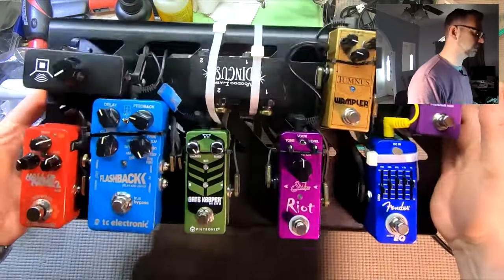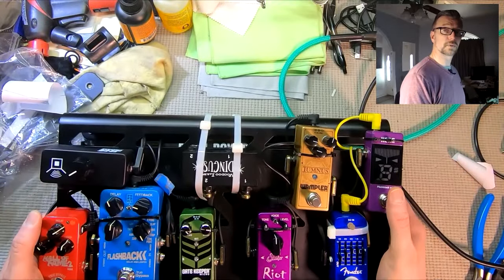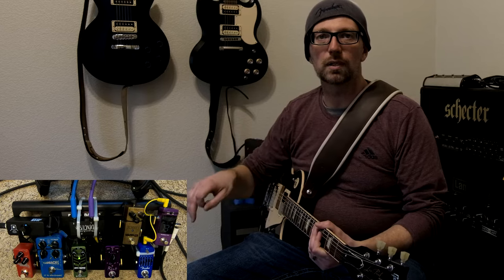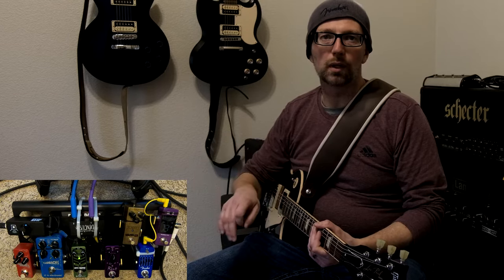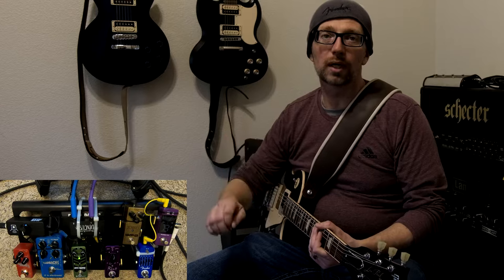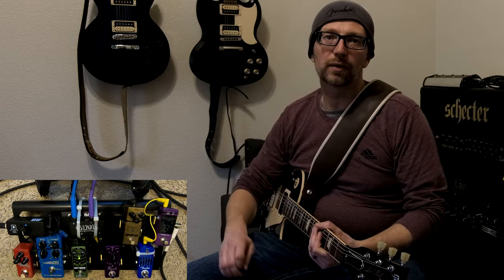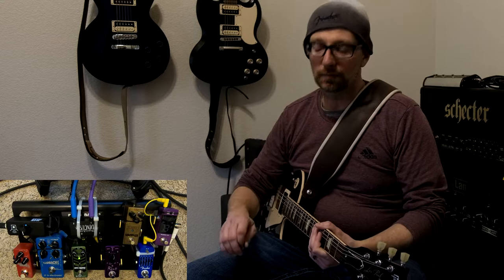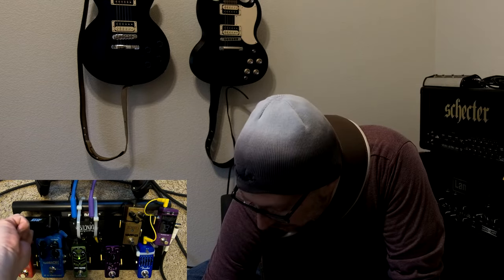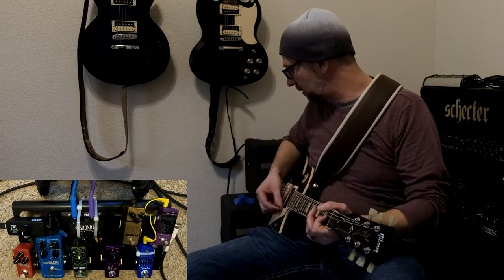So I'm itching to go plug this in and see how it sounds. Let's go check that out. So I've got the pedal board hooked up. This is my clean tone. And the way we've routed this is that the white cable is the input from the guitar. The number one on the Voodoo Lab dingus is the pass-through cable that's going to run to the amp input. The blue cable is returning to number two, passing back through for our back end out of the amp send. And then finally, our volume here is our final piece of the back end chain that plugs into the amp return.